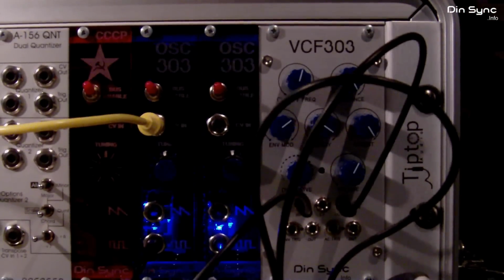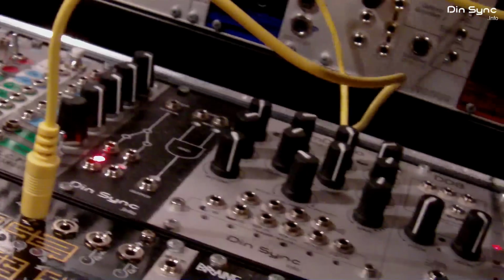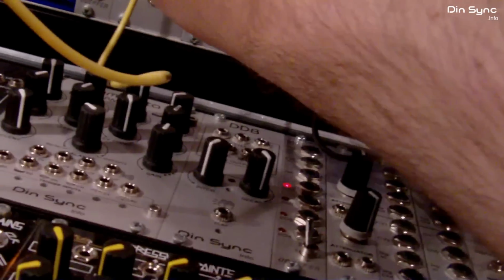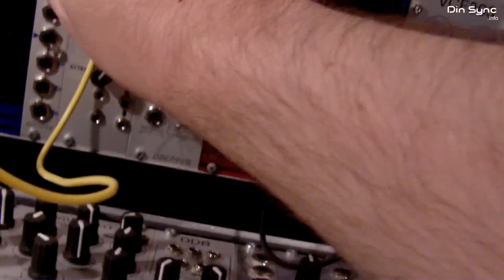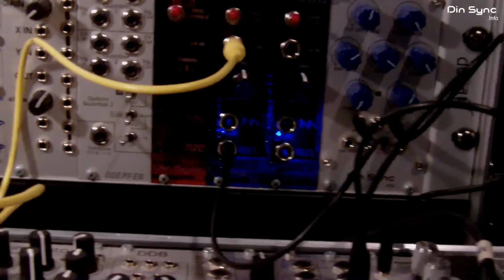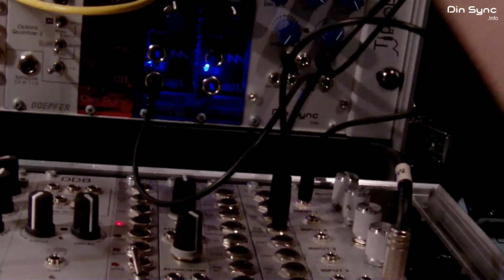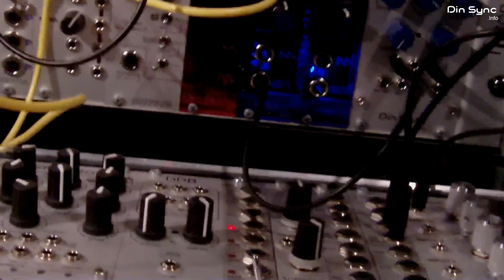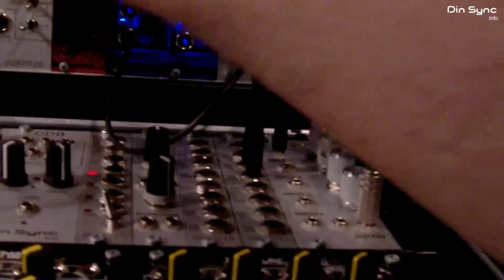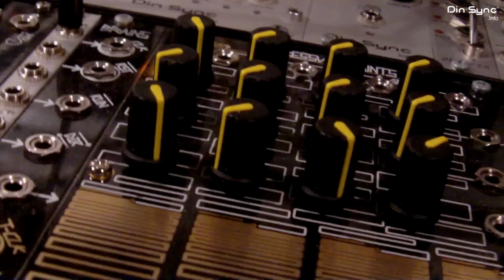and then we need to get the clock sorted out. So okay, I'll take the clock division number 1 from the RCD, which is the same as a standard clock, put that into my special A180. This one is actually a buffered DIY, but we're just splitting clock signals. It should be enough just to use an unbuffered multiple. And so I'll take the clock out of there into my small mini multiple there.